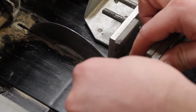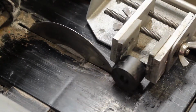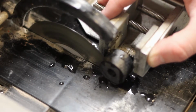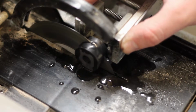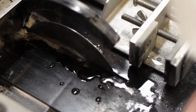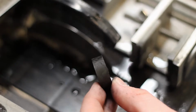And we have a nice diamond bit saw, a little 6-inch saw. Really nice. I'll add water, to make sure it doesn't ruin my saw, and it just cuts really easily, as well as keeps all the carbon fiber dust from going everywhere. So we'll slide that in real easily, get that 8 millimeter cut. And here we go. There's our 8 millimeter piece, so we'll put that aside.